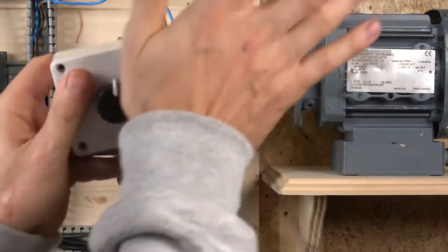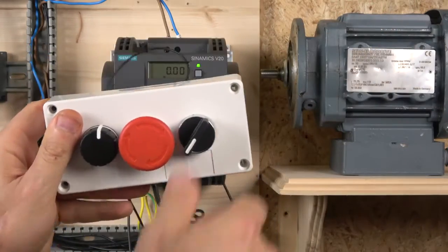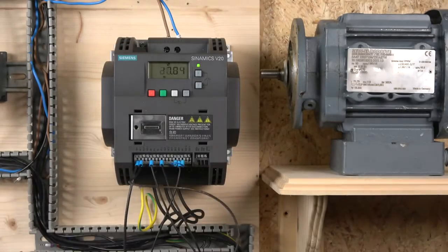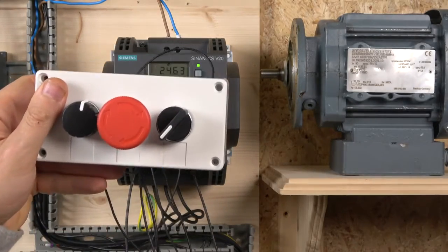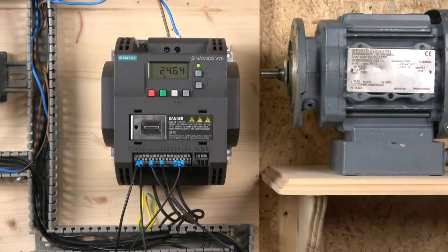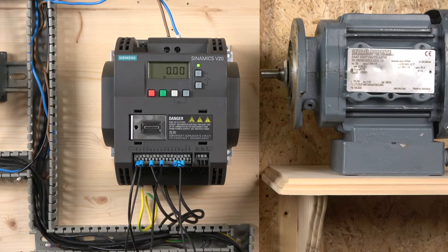And in an event of emergency, I could do that, rather than try to flip the switch, and then it shuts the drive down. But I mean, you open it like that, it will start running again. So be aware, you always need to make sure you do that. As I say, it's a very crude way of showing how to get that 2-wire going with macro group 2.